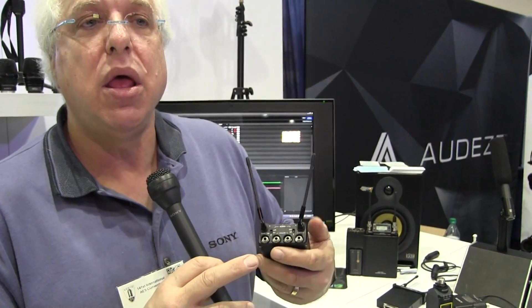One is that there's a built-in mixer function in here. If you realize that this is two channels in and two channels out, does it follow automatically that channel one has to go out channel one and channel two has to go out channel two? No. We have a built-in mixer function on each channel that allows you to assign channel one to go out channel one, channel two, or literally be assigned to both channel one and two at the same time. Same for channel two — go out one, two, or both at the same time.